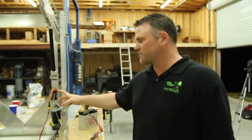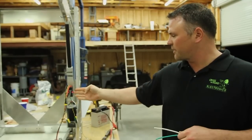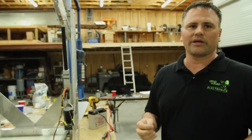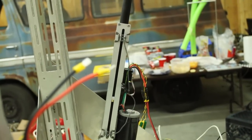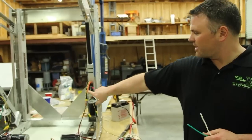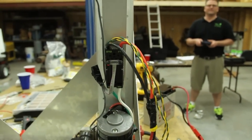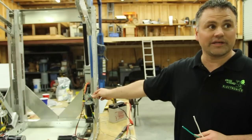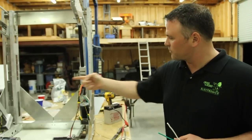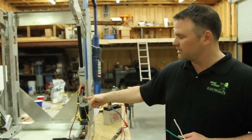So we took a Talon SRX, which is new this year, connected it to two limit switches to limit the travel of the actuator, and all the closed looping on the limit switches is done inherently inside of the Talon SRX — so there's no additional coding needed, you just wire it up. It defaults to the normally open position and handles it for you. Basically right now if you look at the LED pattern, it's strobing from left to right. The last one that illuminates indicates the direction — it's pointing to the positive lead, meaning in the forward direction it's limited. If it were to limit in the reverse direction, the flow would travel that way, lighting up the other end, indicating it limited in the reverse direction.